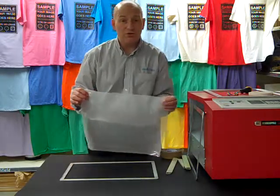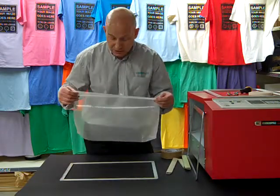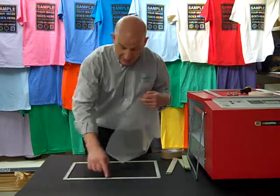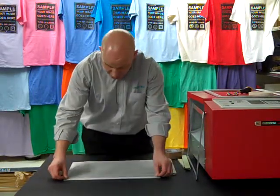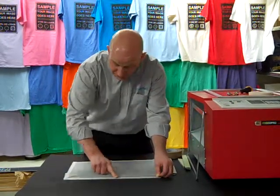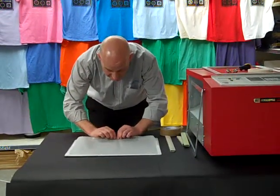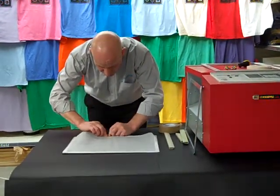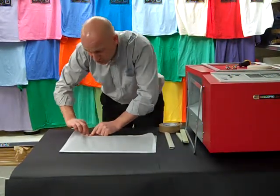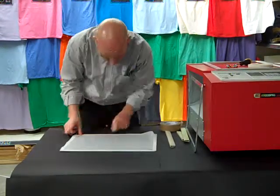As your film comes out of the machine — your master material comes out of the machine — you take your smooth side and put it down onto the double-sided tape. We've already taped up the frame with double-sided tape, and you just stretch this across on one side first. I always do the side that's furthest away from me. You then pull this across the frame, giving a little bit of tension and sticking it down. You need to apply a little bit of pressure to make sure that the film is adhering to the tape.